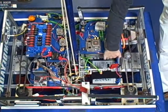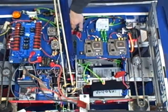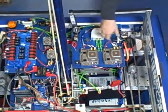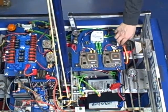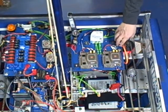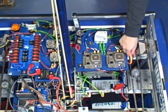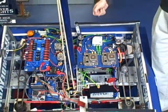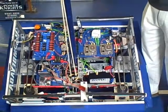The pressure relief valve must stay with the compressor itself. You can have the pressure switch working to the high-side gauge and your regulator off-board with the compressor. But remember, those are still required components that need to be inspected even though they're off-board — you are essentially just taking tubing from your off-board compressor to the robot. The solenoid switch must still be wired into the digital sidecar and controlled by the robot for usage.